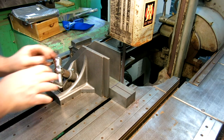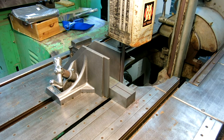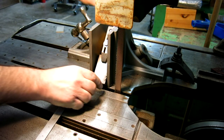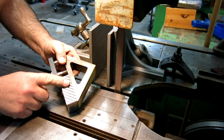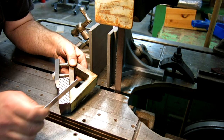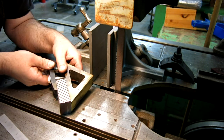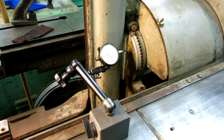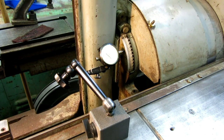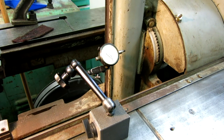Looks good. That's the start of the cast iron lap. Now I'm going to reverse this thing and cut grooves in this direction too. I have a precision stop set so that all the bottoms of these grooves end up in the same spot. Here's my precision stop — when I come up to the indicator I can just go to zero, and I know with pretty good precision that all those saw grooves are at the same depth. It's just a workmanlike touch so they all end up at the same level and look nice.